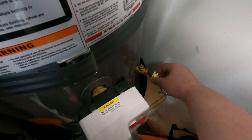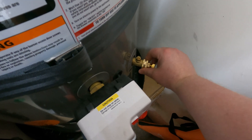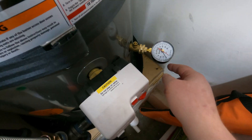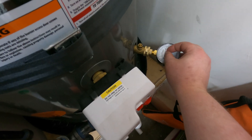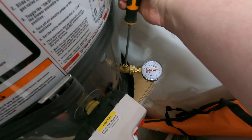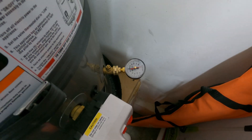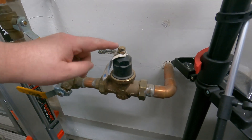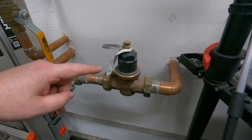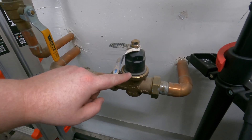So I'm going to put this gauge on the water here — that's a pretty common thing to do. It's also worth mentioning thermal expansion. That's showing 100 PSI as well, so we have way too much pressure. If you look at this PRV, this bolt is pretty much bottomed all the way out. I'm guessing the last owner had the same problem — not enough flow — so they just kept increasing the pressure trying to get more. I'm hoping the problem is right here in the PRV.